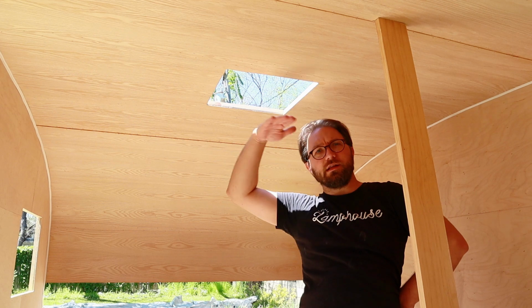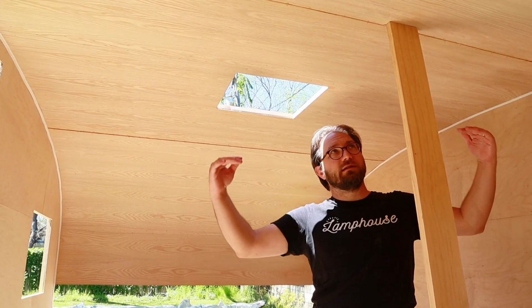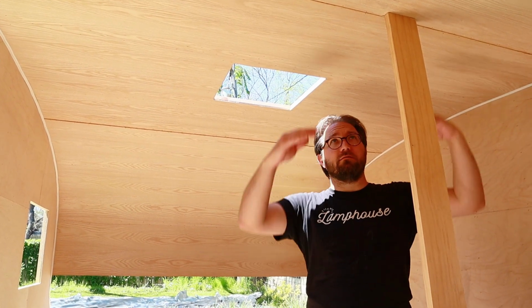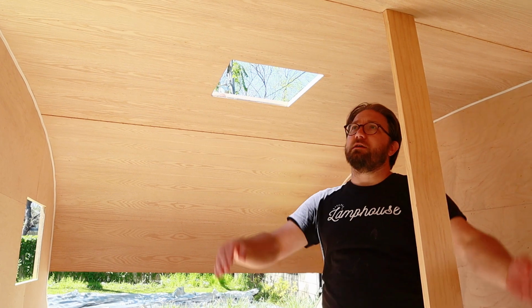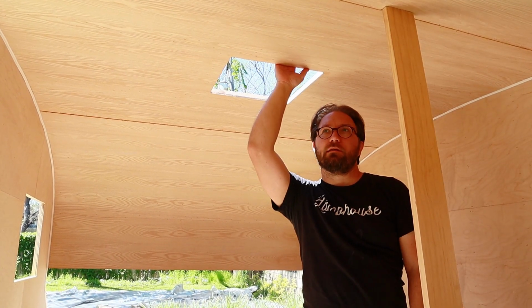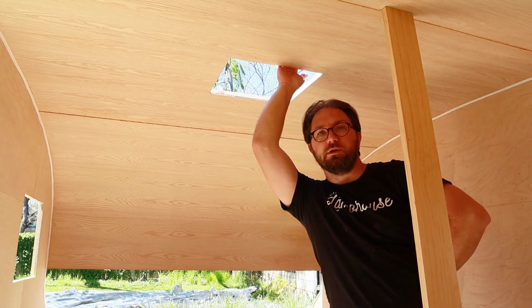We used a ceiling joist that had a big knot right in the middle of the board, and I think that weak spot has caused it to dip. So rather than pull all that out, because it's right here on the seam of two different boards, I think the thing to do is to just reinforce that, and that aluminum should be strong enough to keep it from dipping.